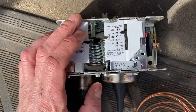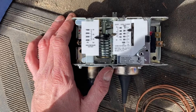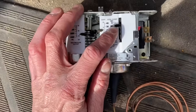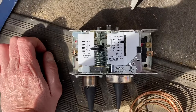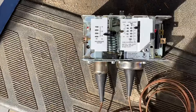On the low pressure side, you've got your high point and your differential. I get a lot of questions on what I set these at for different types of refrigerant. Honestly, I set them all the same — I usually have them cut in around 20 to 25 PSI and shut off around 0 to 2 PSI. That's just what I prefer.